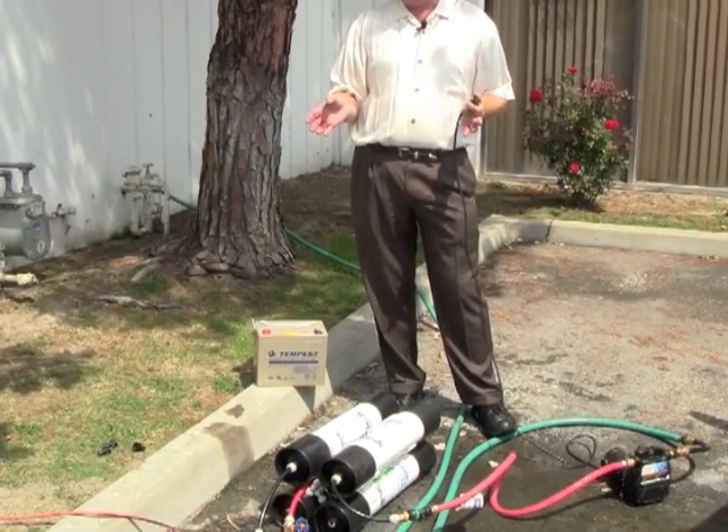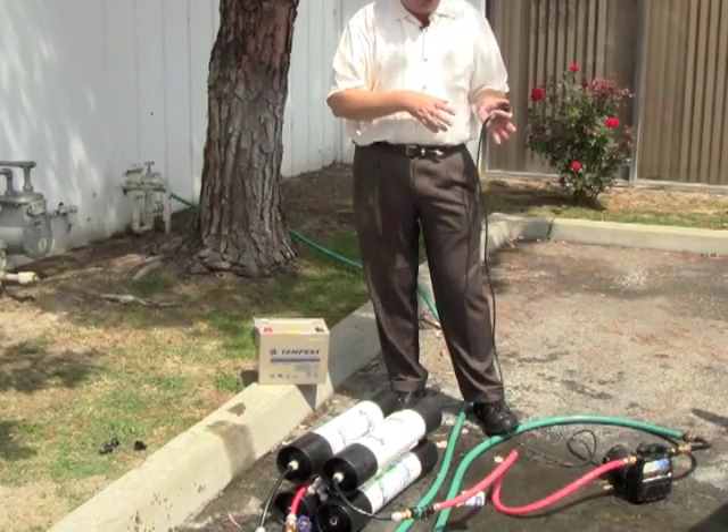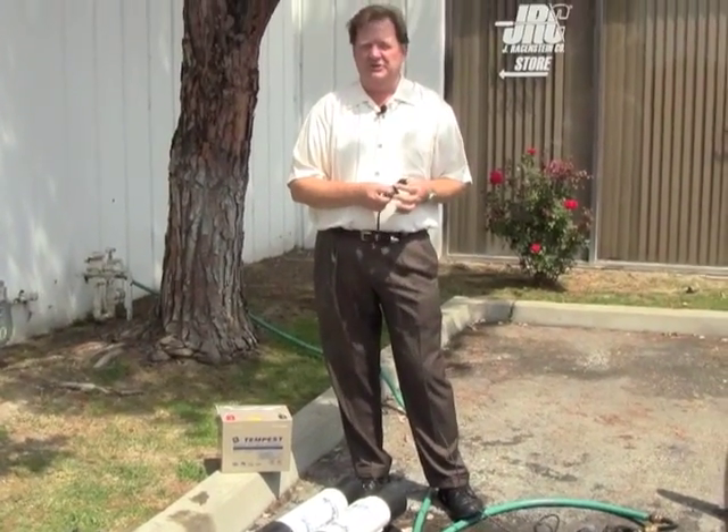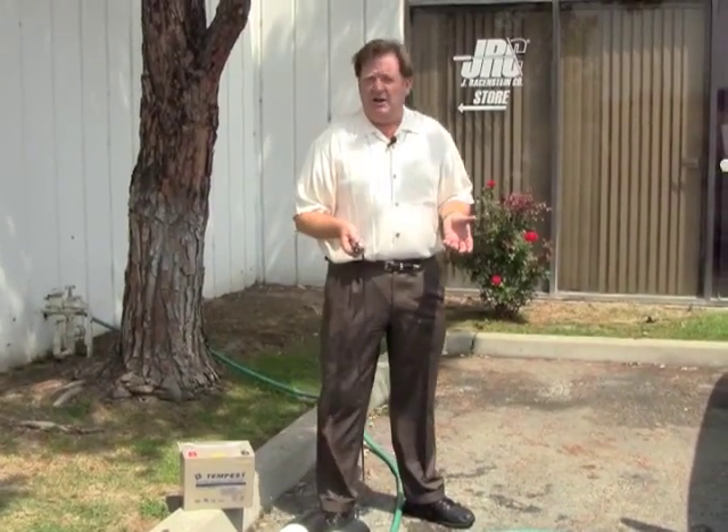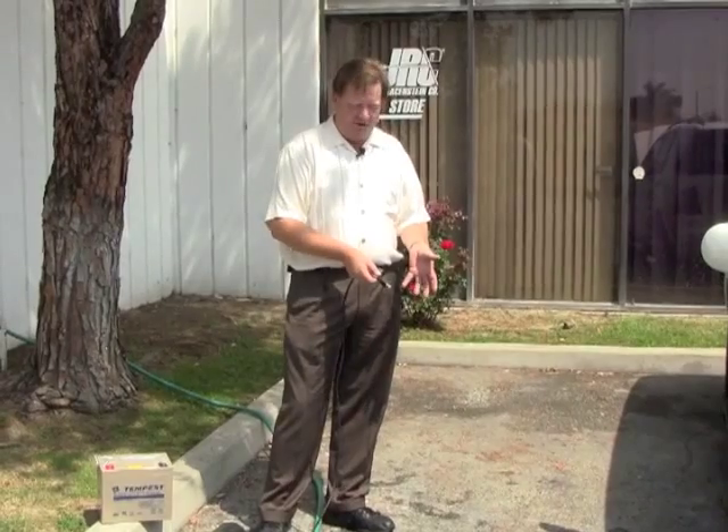Horsepower is about 740 watts. There's an inrush current when you start a motor up, so I expect that we'll see with a half-horsepower pump somewhere around 740, 800, maybe 900 starting watts required to get this thing to roll.